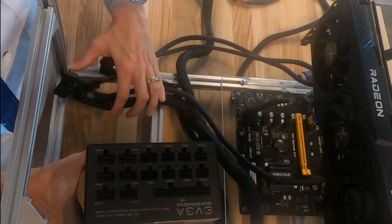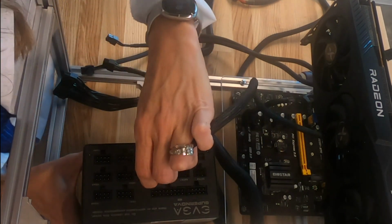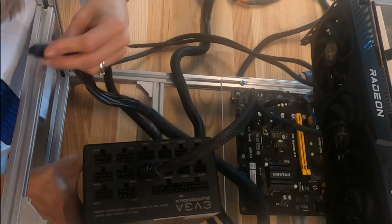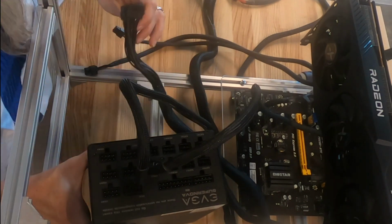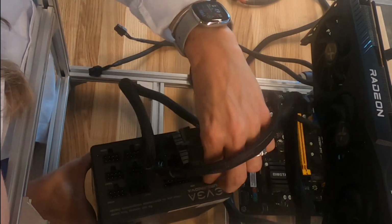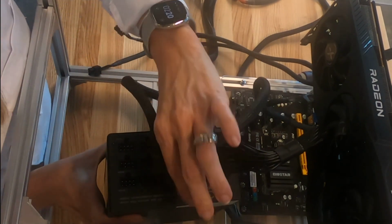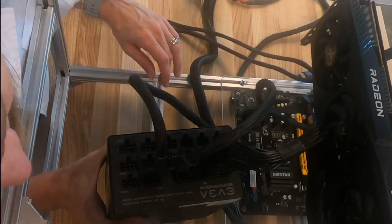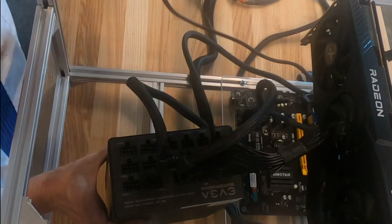First, attach the CPU to the power supply with a 2 8-pin connector that will attach on the other end of the motherboard. Use the VGA cord. This will attach to the riser. The 24-pin will attach the power supply to the motherboard. The peripheral will attach on this motherboard and requires extra power connection with 1 SATA and 2 Molex. You will want to connect the 24-pin to the other power supply after you have done this.